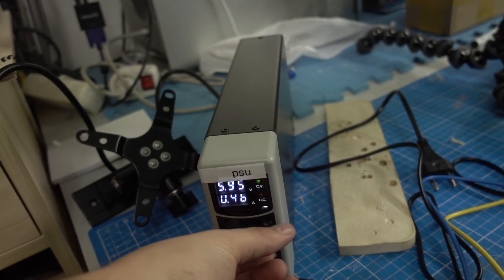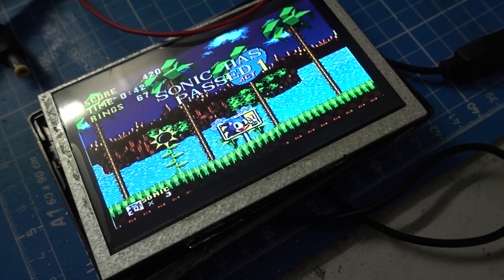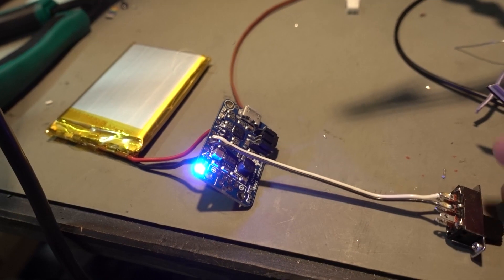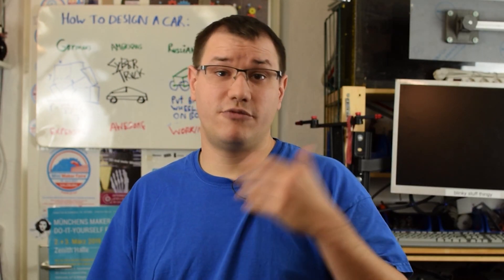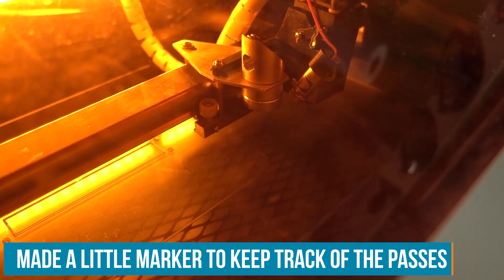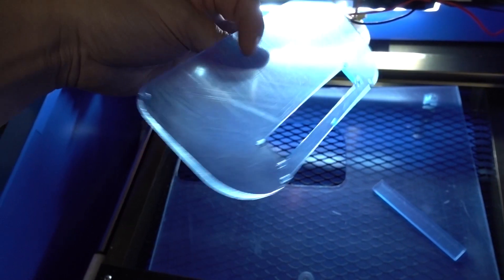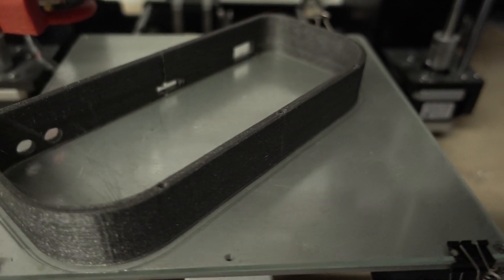While doing the pinout I verified that the unit will run on 5 volts, but the screen needs at least 6 to 6.5 volts for a clean picture. So I added a boost circuit in addition to my Adafruit Power Boost 1000, which charges and connects the LiPo battery. The Adafruit module pumps the 3.7V from the LiPo up to 5V, then another module boosts it to 8.5V, which evens out to about 6.5V after voltage drop. The Genesis can withstand up to 10V and the screen is fine up to 12V, so there are no issues there.